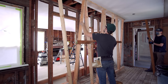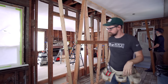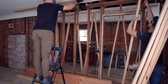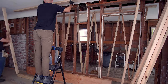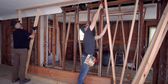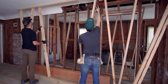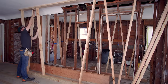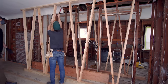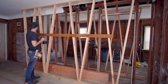The temporary walls feel rock solid and are not going anywhere. These temporary walls are really easy to put in — you cut extra long 2x4s and wedge them in. The corners latch into the 4x4 at the bottom and the 2x6 at the top. The 2x6 at the top is to distribute the load on the ceiling so you don't break the plaster. You also don't want to hammer them in too hard — just enough to stay in place — and once you put the cross braces in, they become incredibly strong.